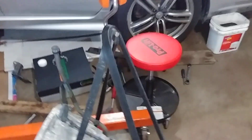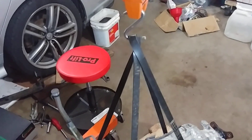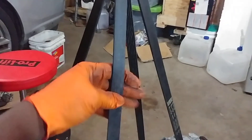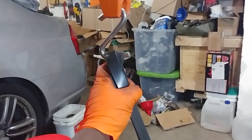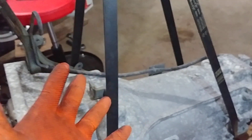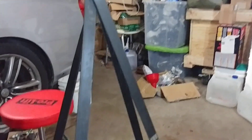So this is the insanity part I want to talk about — why use belts? Are they the safest thing? Probably not, but I took this as a teaching opportunity. Serpentine belts, V-belts — whatever you want to call them — are generally engineered to withstand quite a lot of force as long as you use them in their normal operating plane. They're usually loaded like this, with a pulley spinning and grabbing. As long as you're loading them in their normal direction of work and design, they're going to be very strong. The problem comes when you start putting twisting forces or shear forces on them. A slipping pulley, or a very sharp surface that notches the side — that's when you start weakening the belt. But otherwise, loaded correctly, it will withstand quite a lot of force.